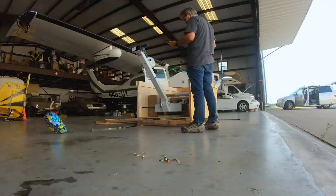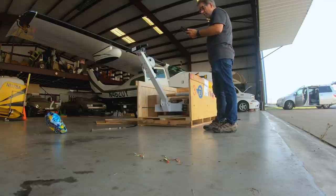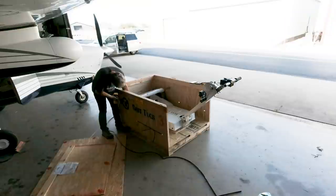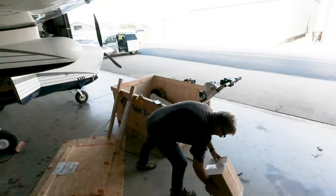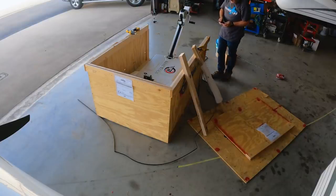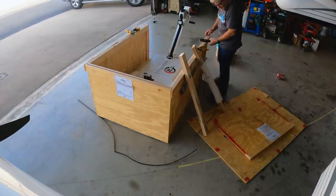On lateral sides of the crate marked with red threes, remove the screws marked with red paint. This will remove the 2x4 board. Strap holding the cardboard box. This box holds the accessories that you need. On the removed end of the crate, take the two 2x4s and stack them on top of each other on the ground at the end of the crate.